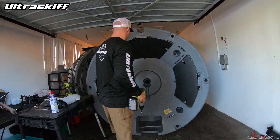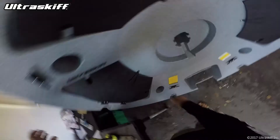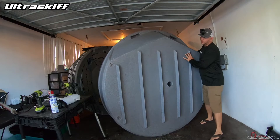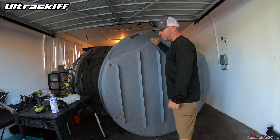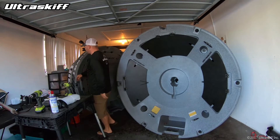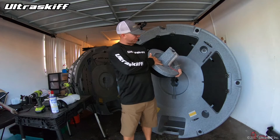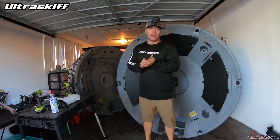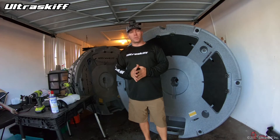Use as low a torque setting as you can on the hinges. You've also got J hooks on the back of the boat — tighten them up if needed. There are four utility inserts that rarely ever loosen up, but you can WD-40 them if you want. For the pedestal mount, the only thing I've ever seen is the bolts underneath loosening over time — just ratchet them down and you're good to go. I hope you guys enjoyed this video. Any questions, contact us at info@ultraskiff.com or visit www.ultraskiff.com. Thanks for watching, and as always, tight lines!